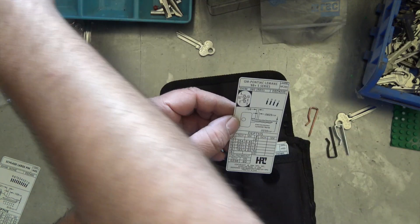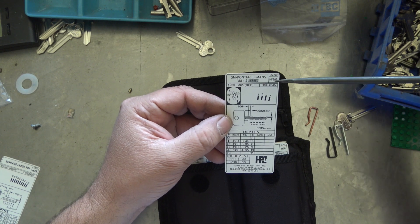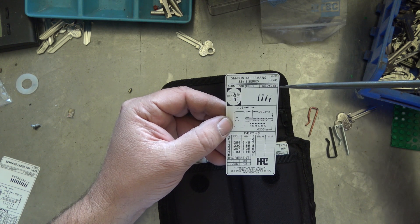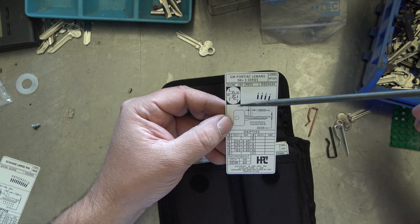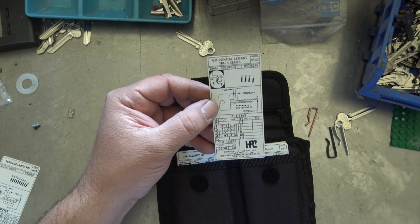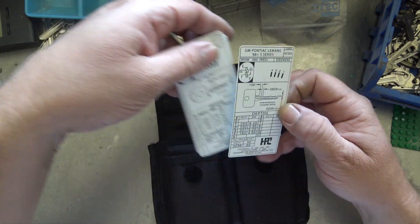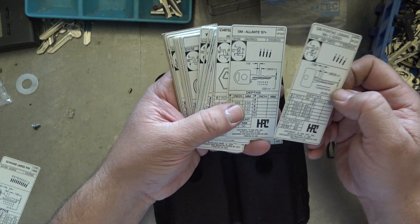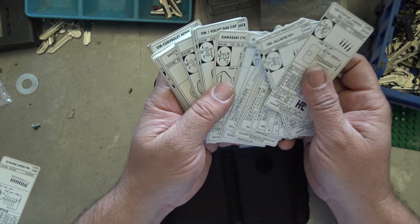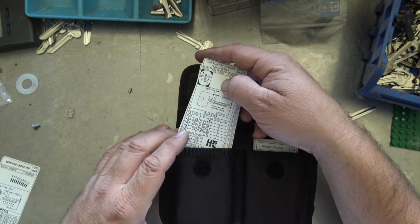Here's my little pointer. Here is where it tells you what shim to use. Here's where it tells you the series. It's got its own little card numbers - DSD: data, space, and depth, I believe. Shows you the profile of the key, shows you the depths, and all the space and measurements are all on there as well. So you could actually hand cut a key using those space and measurements. And look at this - we've got GM, Chevy, Mazda, Chrysler, Mercury, Yamaha. These are pretty cool if you're doing automotive or even just pin tumbler locks, because we've even got Lockwood in there as well.